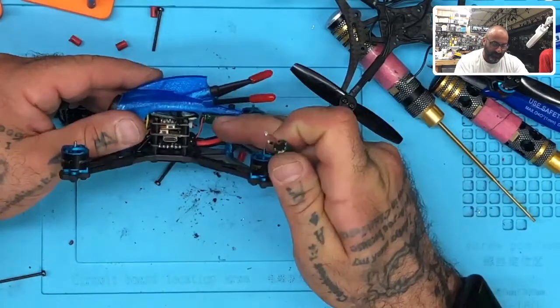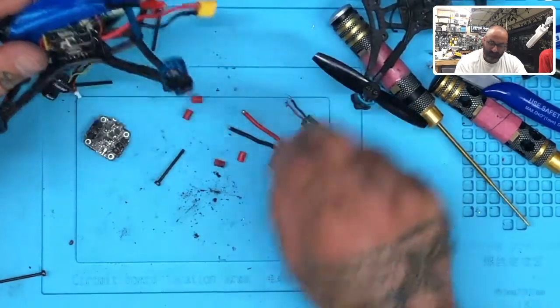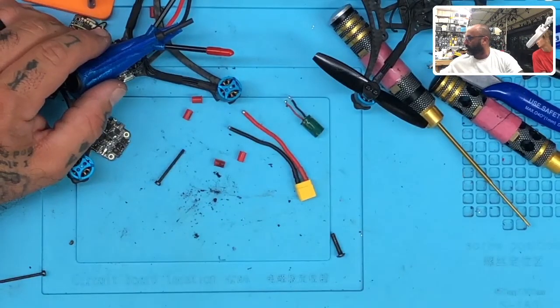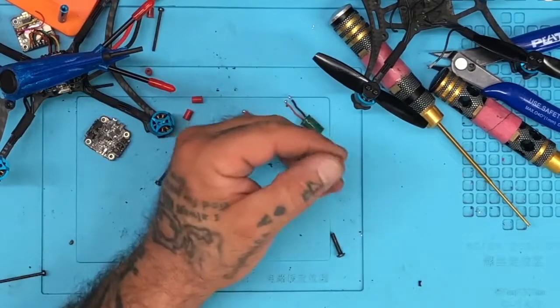It looks like this may have been cranked down really hard after the customer opened it. What I do know is the capacitor is not sitting up here when it wrecked — I do know that it was sitting against the carbon fiber, and for all I know that could have shorted out. One of the things in the picture that was really important was the compression you can see on those standoffs that are black. They're supposed to be red standoffs between the flight controller and the ESC. That is so compressed right there — they're bent. They don't melt; they just have burn marks on them. When you take them out they completely stretch back out.